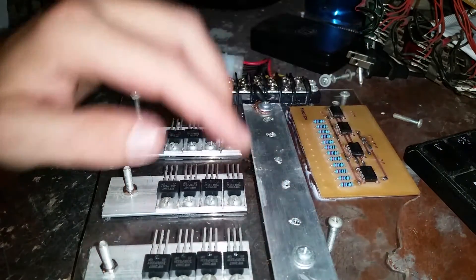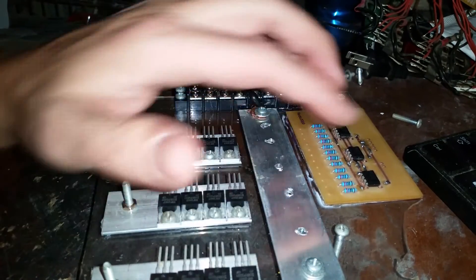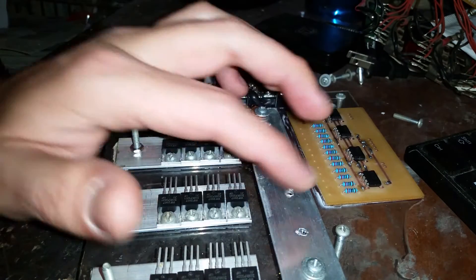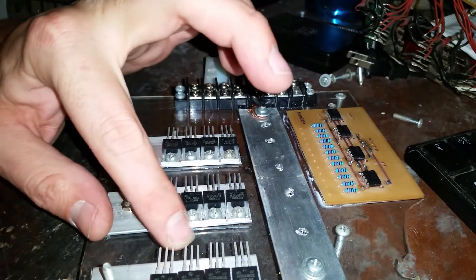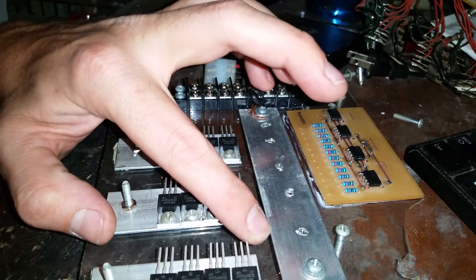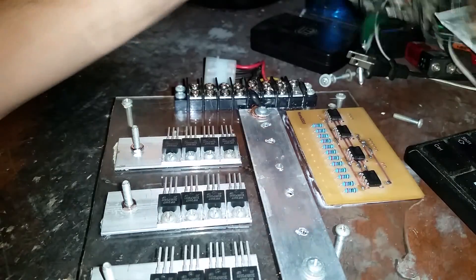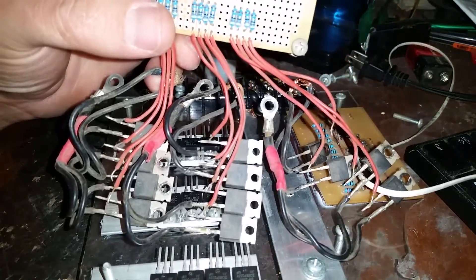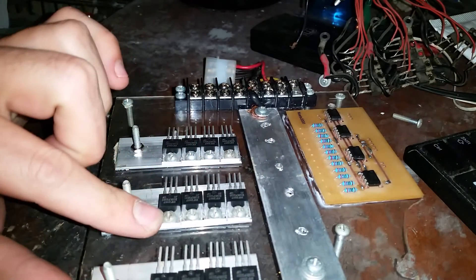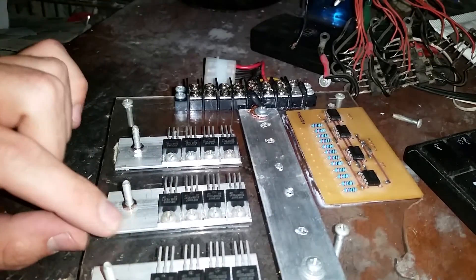At this point I still need to run the signal wires from the resistors to the MOSFETs, and I also need to put ground from each one. The ground is this guy on the outside, signal is on this side here. I ended up taking out the metal pin and you get your contact right in here on these pads. That's why I'm using this aluminum block here — I figure the aluminum will keep the heat down.